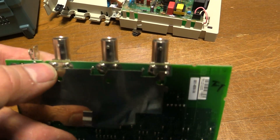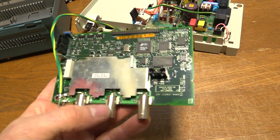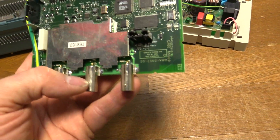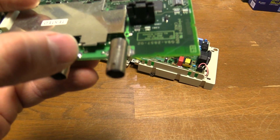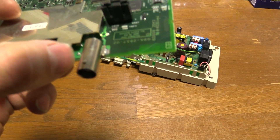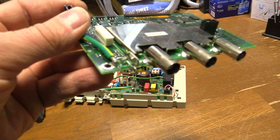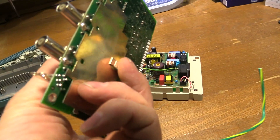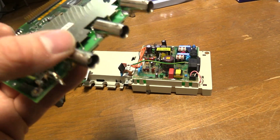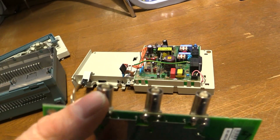So I looked at it and thought, well, if it's not a cracked solder joint, it must be inside. So how can I fix that without replacing these, because I don't know if I can get them anymore — the scope is so old. I had a close look and it turns out they had solder pads on the top here which weren't covered by the solder resist mask. You can kind of see where I've soldered. It took a bit of heat and a bit of flux. So that means this barrel here is directly connected to the ground strap, not just through those pins which came loose — so I've actually got a better ground from the BNC to the ground plane.